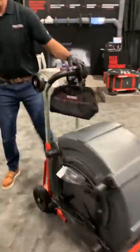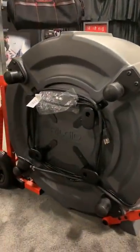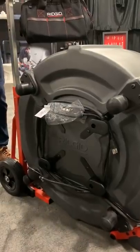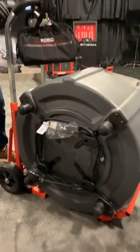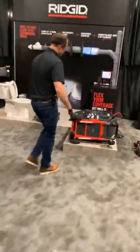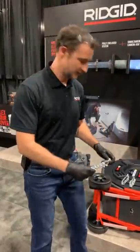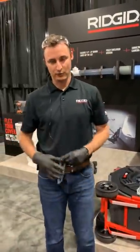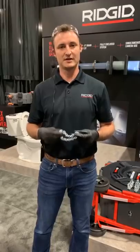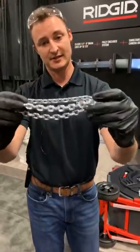The clips on the back of the machine can rotate to quickly dump your cords on and off, getting you to work faster. Now I want to talk through the different chain knockers and their applications — the drain cleaning philosophy. Flex shaft is high-speed and finesse first, not force. For any soft blockage in a soft-wall pipe, we ship every machine standard with plain smooth-style chains. These are great for PVC and soft-wall pipe, and they will clear wall-to-wall even through very small access points.